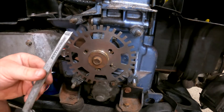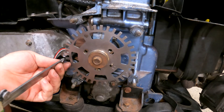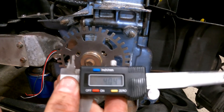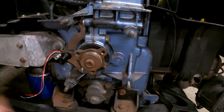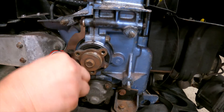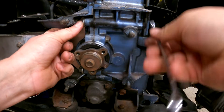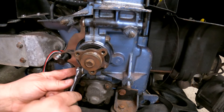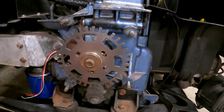I'm going to use my calipers here — using the little pokey end — to measure the gap. Holding it nice and straight, I'm getting about four millimeters. So I'm going to bring the bracket as far forward as I can and see what that looks like. Bringing it all the way forward now, let's remount this and check the distance — I've confidently brought it up at least two millimeters.